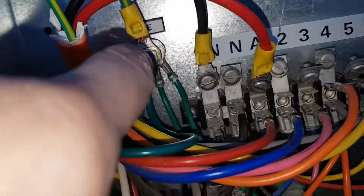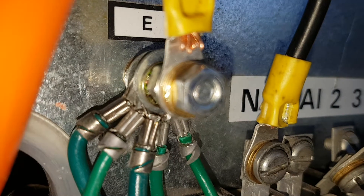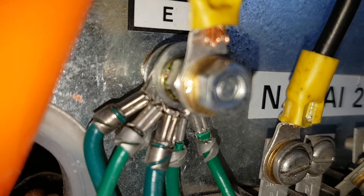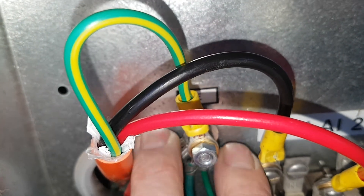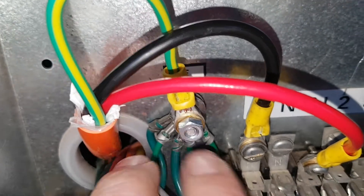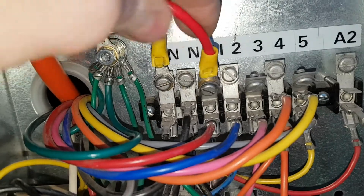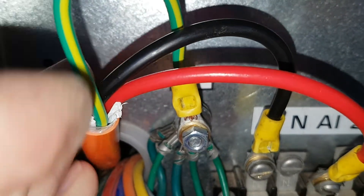There's a neutral and there's the earth. What I did — I actually took all this right apart — probably can't see much, but it's all held together with stacks of nuts and a bolt. The whole assembly was loose with regards to the chassis, and that's the chassis ground. So I've got two of those brass washers on each one of these — underneath there — two brass washers, same with that. It's all secure, nothing can move around except the fact that that flexes. Same with this and that — everything's tight.